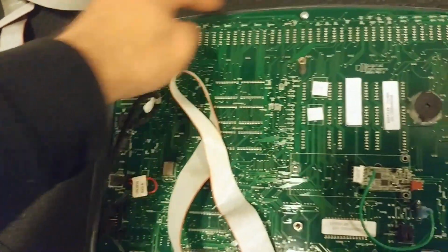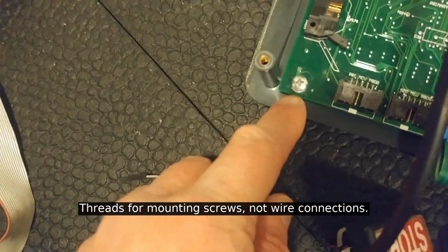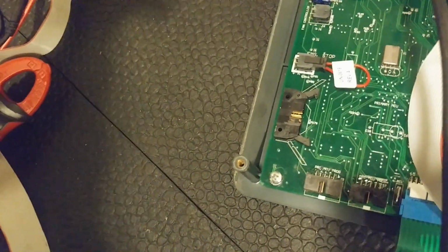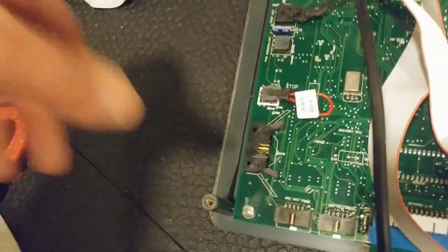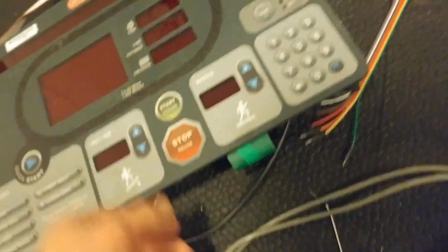We've also got all these screw terminals all over the place. And underneath these, we'll see there's a little solder pad as well. So if we touch the ground and touch that and see continuity, that is further confirmation that we've really found the ground, because a screw terminal is the sort of thing you would ground on your board. And sure enough, I found that, and that was hint number 1.